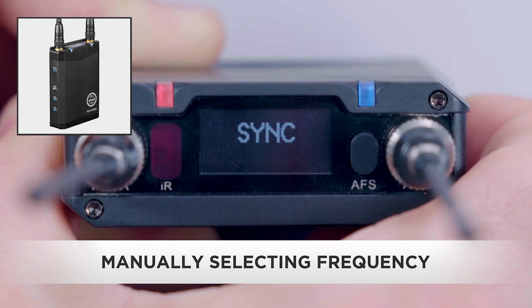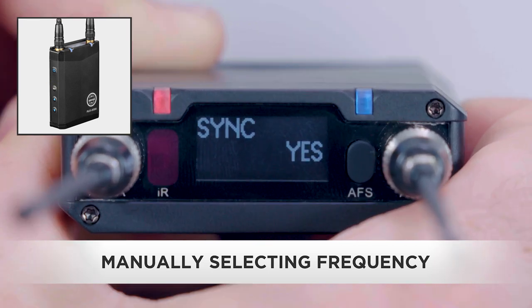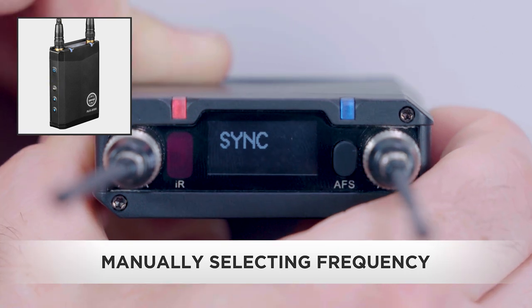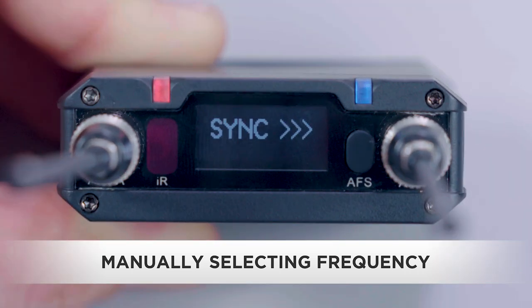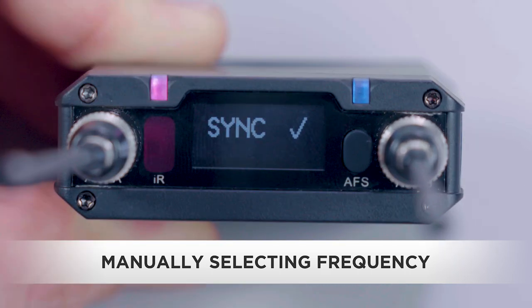With sync on the screen, press the set button. The yes/no prompt will flash on the screen. Use the up/down buttons until yes flashes on the screen and press the set button. The sync indicator arrow will show on the screen. Make sure the transmitter and the receiver's IR ports are facing each other until sync with a check mark appears on the screen of the device that's initiating the sync.